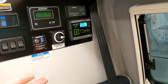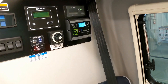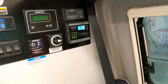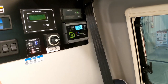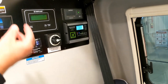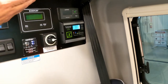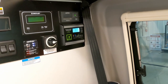On a beautiful sunny day at noon with batteries needing a charge, you should be at least 8 amps or above from the solar. If you're not, the panels are dirty — crawl up there and clean them with soap and water or Windex. That's the telltale sign they're dirty. One thing to check: if batteries are at 95% or above, it automatically steps down because it doesn't need a charge.